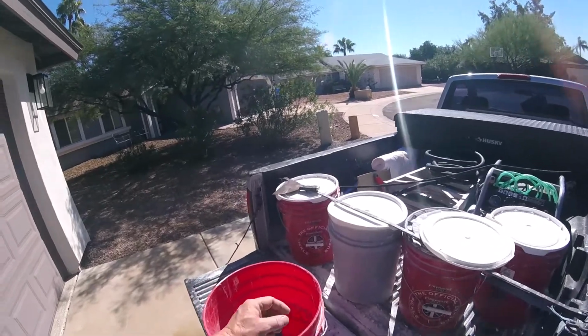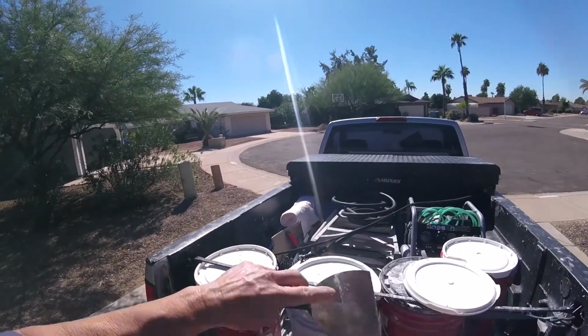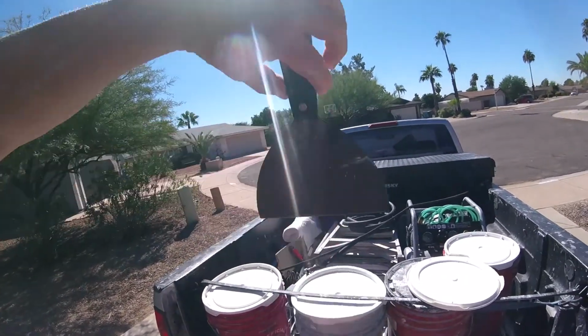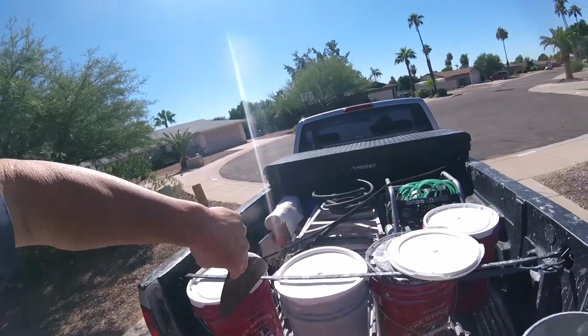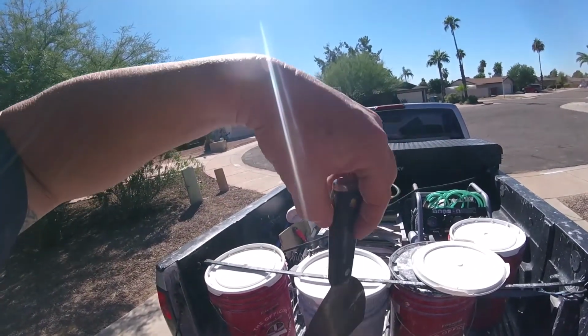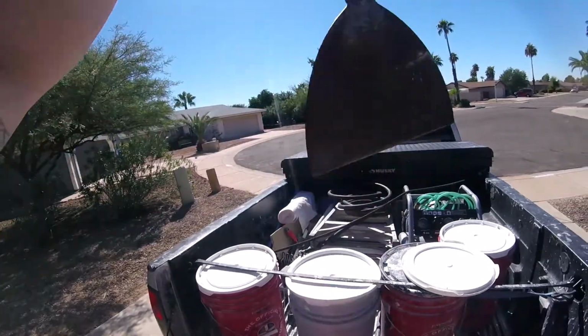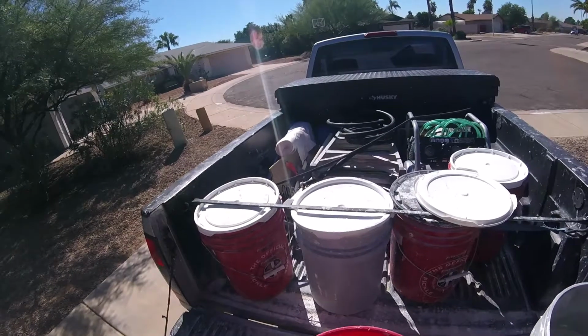I always knock down with a clean 6-inch knife, my nice square 6-inch knife. Lightly knock it down. I'm just gliding over it. Glide, glide, glide. I'm not pushing down. No pressure. I'm just barely holding on to the knife, gliding over it with the same glide pattern on all of it to create the knockdown.